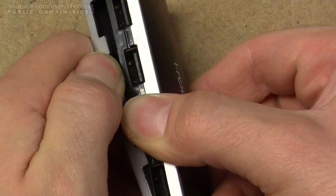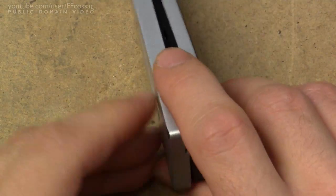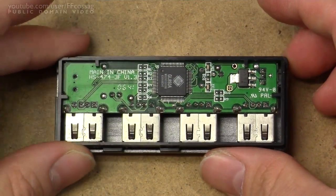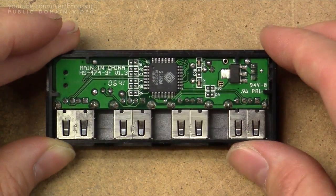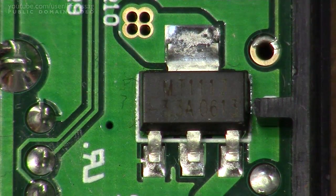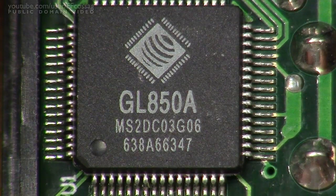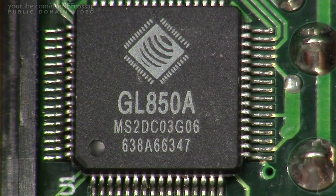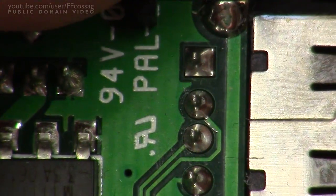There we go. That's the inside of the old one. We've got a pretty tidy layout of some kind of regulator-looking thing there and an actual branded IC. The regulator seems to be just a run-of-the-mill 1117 3.3 volt, and the IC is a GL850A — MS2DC03G06638866347. Everything looks really quite well made.